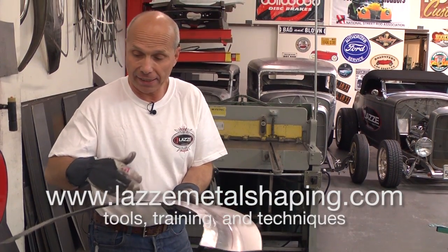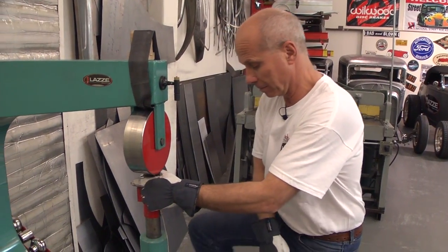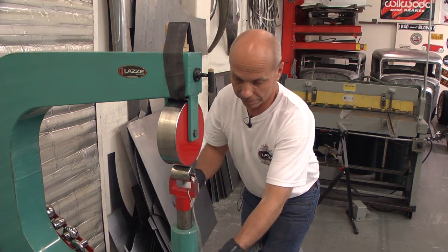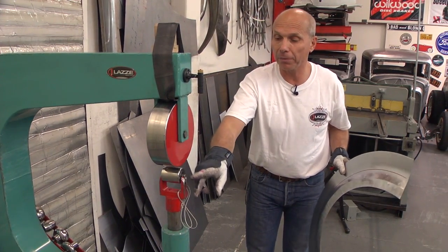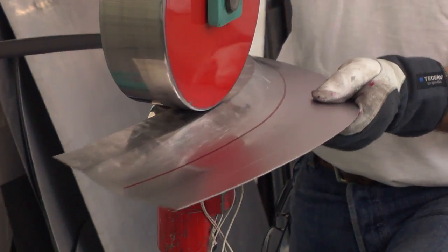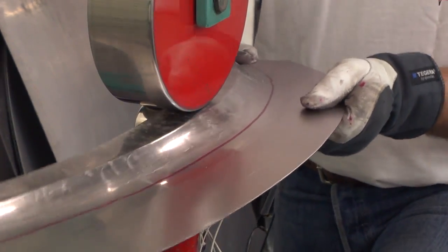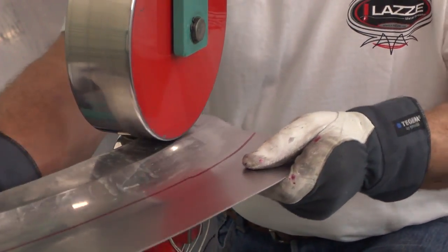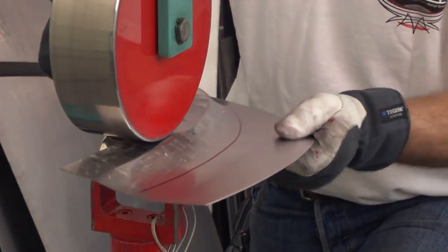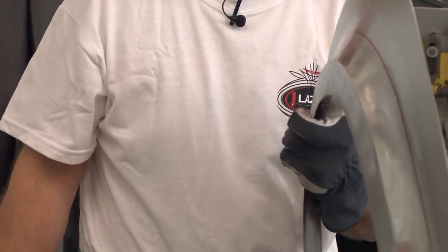I can take the flattest wheel in the English wheel and do that to show you one more thing. I'm using the shim on the English wheel and I'm just going to roll this with light pressure. That way I have less to grind off in the end because there are some marks from the shrinker. Now the surface is more flat, so I don't need to grind and hammer and dolly it so much. I prefer to use the equipment as much as I can.